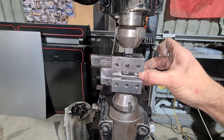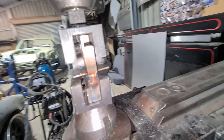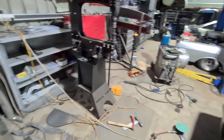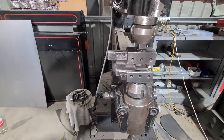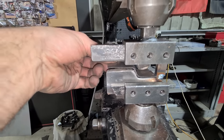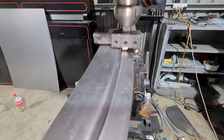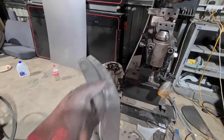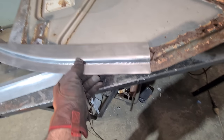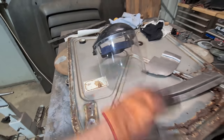With the fence system I just need it to be 25 mil from there, so if I weld a little chunk in there it won't let me push the sheet past it and it should act as a guide. Just got that little block welded on — for one-time dies like this there's no need to go crazy, just use the shitslinger and get it done. With any luck it won't let the sheet past that stop.